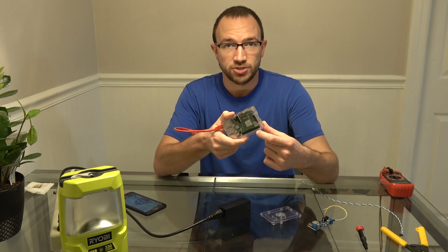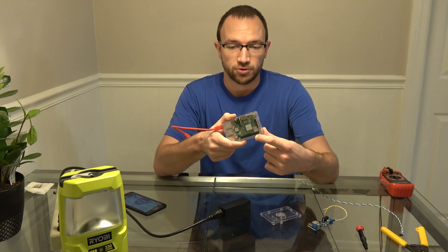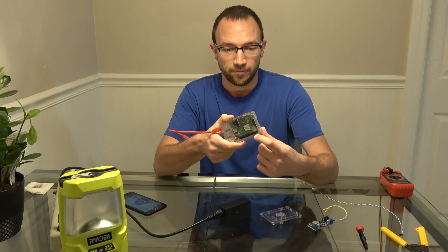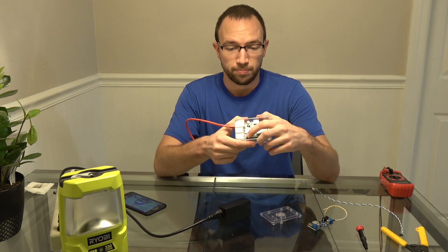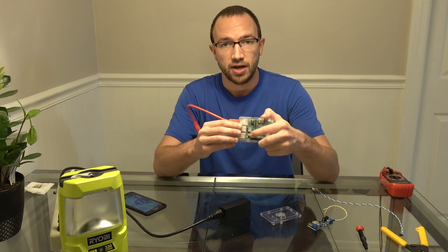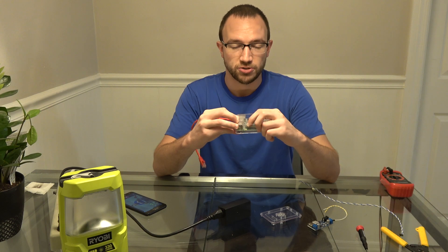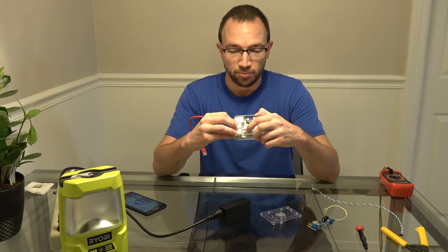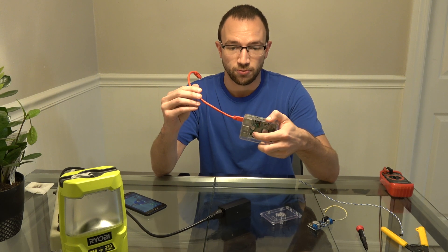You may want to consult the official Raspberry Pi GPIO pins before connecting anything to these. The way PoE works is using simple bias tees on the input Ethernet transformers, separating the voltage from the wires while still allowing gigabit Ethernet through. That is why we have four — because that's four pairs of wires.